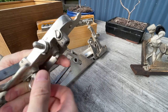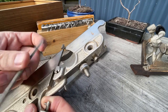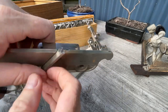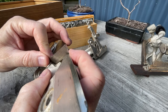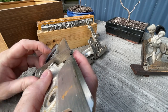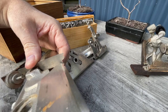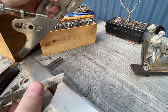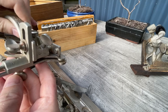So we'll remove that blade and set it aside. If we want to utilize a multi-level cove or bead, we align one side so that it lines up with the top of the skate, as you would with any other blade — drop it in the slot, bring it down, tighten it up. Now the issue is you've got this other side hanging out really low. With the 45, that would cause chatter and there's a chance it would actually cause a breakage.